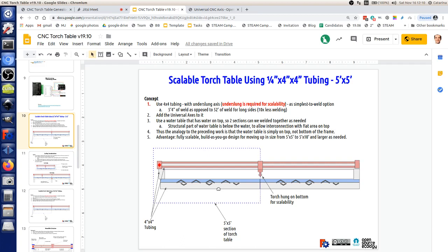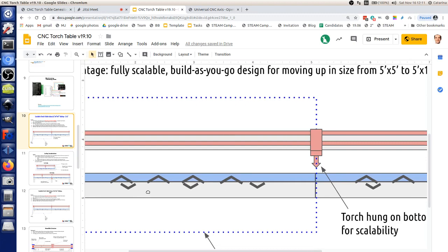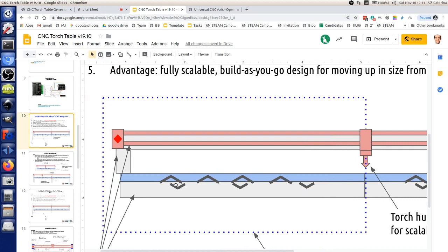What I also have there — you see the support pieces on page 10 — so if you've got this sheet of metal upon which the water rests, that's going to be hundreds of pounds. You want to have a support. I was thinking support angles welded to the underside, in between the frame section, to support the sheet. On top, there are rests upon which the metal workpiece will rest — they don't have to be welded; they can just lay there, so we can replace them very easily.